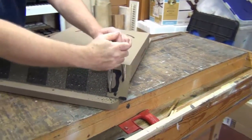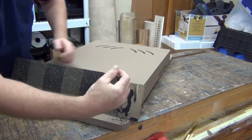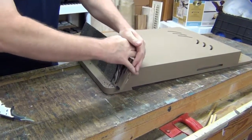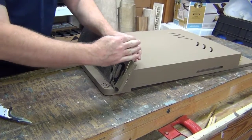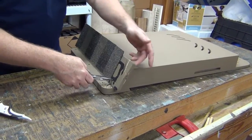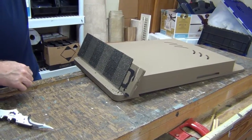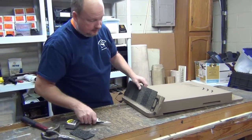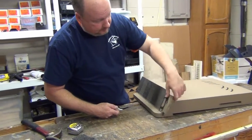The little staples that are holding it, we can pull those out. I like to pull them out when I'm working on them so that I can put more staples in without hitting these staples, and they can be tenacious too. Nothing about this bat house is designed to come apart easily. And if it's damaged to the point that you think the whole roof has to be replaced, it's probably not going to be that easy because the same adhesive sealant is used all the way around the roof. I have disassembled one before and gotten the roof off — it is a lot of work, and I had to destroy the roof panel to do it. But for this type of repair, this is easy.